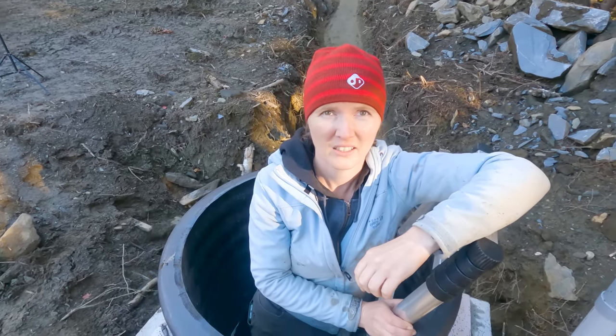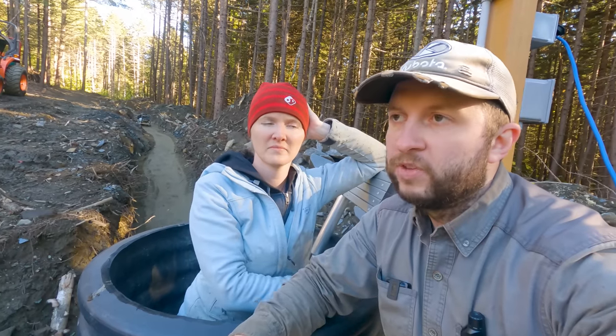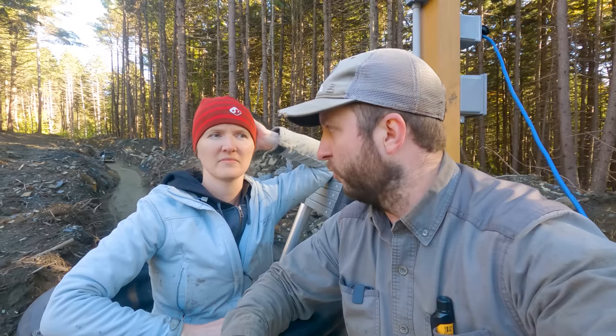There is also, by specification, the way that it works here for the design, at least a day's allowance of volume above the alarm level. So once the alarm goes off, we've still got space for another day's worth of liquid to fill the tank. And the sizing of our tank is 560 gallons per day. That's how our entire septic system has been designed. So even when the alarm goes off, we've still got another 560 gallons worth of capacity in the tank before things overflow and get really nasty.